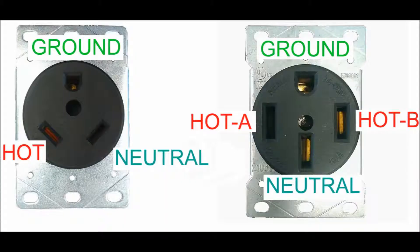The wire should be secured along its entire route, and then at the receptacle end the wiring is as follows. Ground goes to the D-shaped prong at the top of the receptacle. On a 30 amp, hot will go to the lower left facing the receptacle and neutral goes to the lower right prong. On a 50 amp, your two hots — black and red — will go to each side connector; it doesn't matter if you reverse them, and neutral goes to the bottom connector. Remember that you are viewing the receptacle from the side you're plugging in, and not the back where you're doing the wiring.